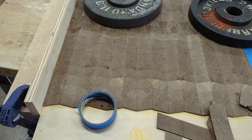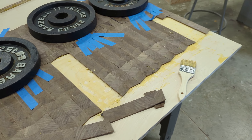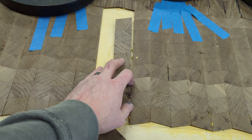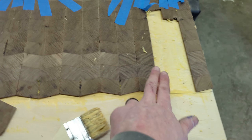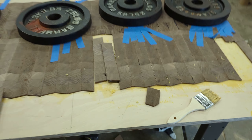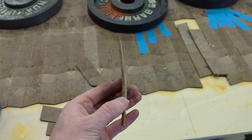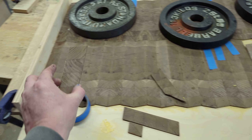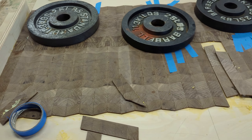This project is beating me up. I thought I had a plan and it was working, but I came back half an hour later and disaster struck. I was working on these veneers — glued them down to the plywood panel, threw some weight on it, walked away, came back and it started buckling. These two were V'd up and there were two more V'd up here. All of these veneers were perfectly flat until they touched the glue, and within seconds they all started to cup up like crazy. Maybe it's the water content in the glue, but I'm going to have to come up with a new plan — I think I'll use CA glue instead and place them all on one by one.